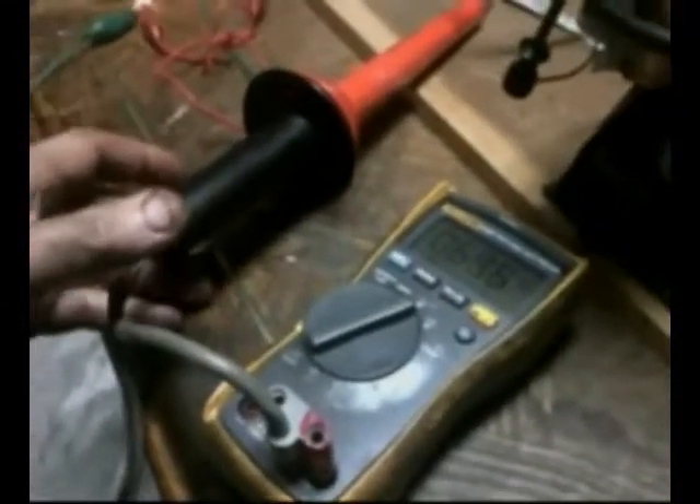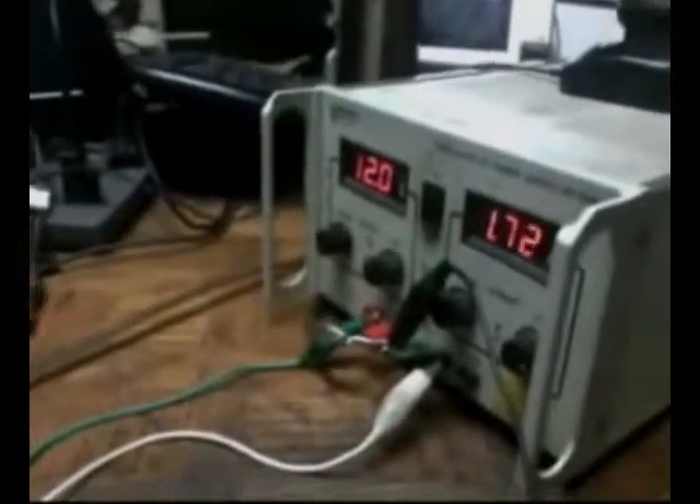This seems to be tuned around 24 kilohertz. Warmed up it's at 24.3 kHz, 500 volts in this area — 600 — and it is radiating out a couple of meters. Wherever metal is attached in this area, it reaches out and can be picked up. I'm trying to keep it contained. Running at 1.77 amps.